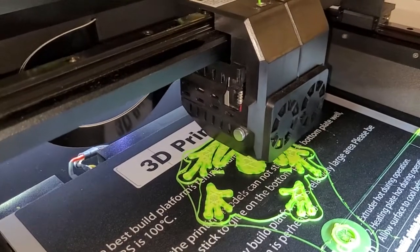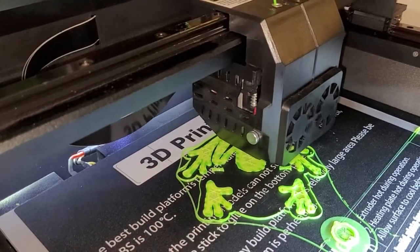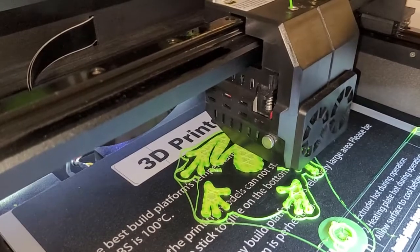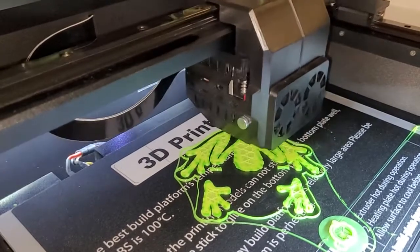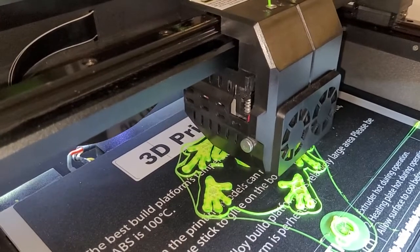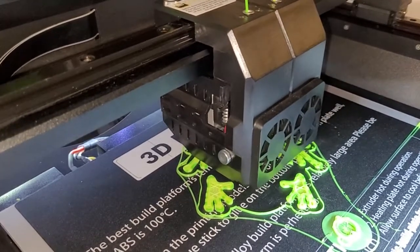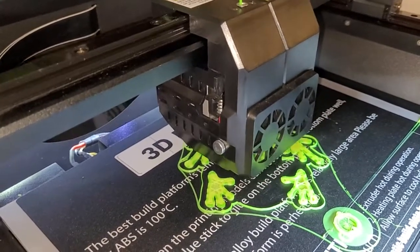The issue is this is a really interesting PLA print where one filament — the green one — is PLA Plus and it extrudes close to 200 degrees with a flow rate of 81. The yellow extrudes a lot closer to 190 degrees and its flow rate is 93. So that was a little bit challenging to get those two to match each other, and that's where I wanted to inform you as to the differences between single extrusion and double extrusion printing.